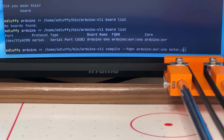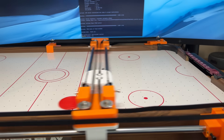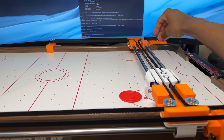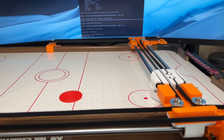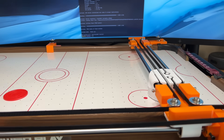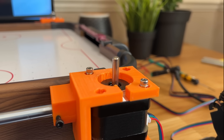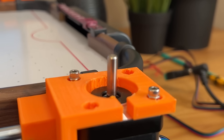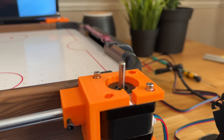All I had to do was upload some code to test the entire system. While I got everything to work at slow speeds, I ran into a small problem of the belt slipping, which completely stops the carriage from moving. The only fix I could think of was to add some code to make the stepper motors slowly accelerate up to speed, which hopefully should work.